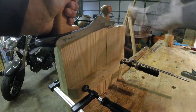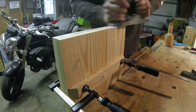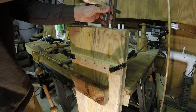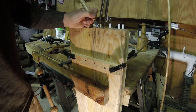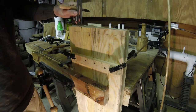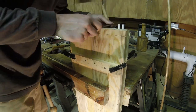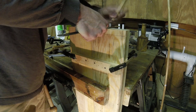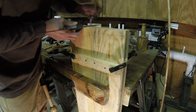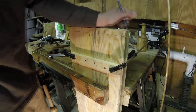For the lid I used my needle-nose vice grips and was able to get a proper clinch on that. Here I'm truing up the ends, making them parallel so I can start cutting my dovetails. My tails are an inch and a half wide and my pins are three-quarters of an inch wide. I really lucked out because that's an even division of the board from left to right, with a half inch on either end through the pins.